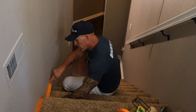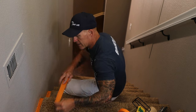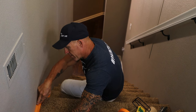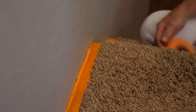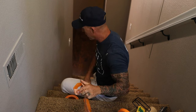I can tightly pull that down and push it and it's gonna make that carpet pull really tight. I'm getting it up against the wall, pulling it down and pulling my tape tight — you can see how that is nice and tight. I walk my fingers along that tape and you can see how tight it pulls that carpet down. Now once I paint this wall and pull my tape off, it flops the carpet right back up — there's gonna be paint behind the carpet but yet no paint on the carpet.